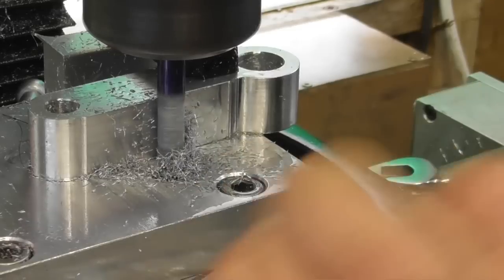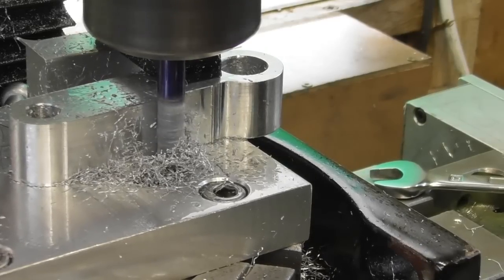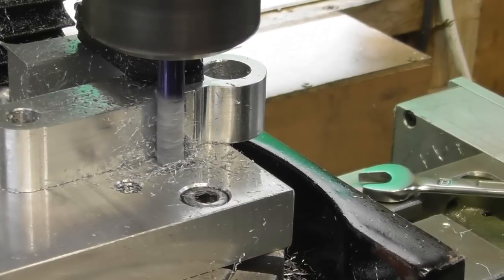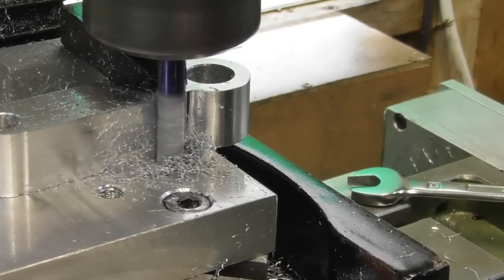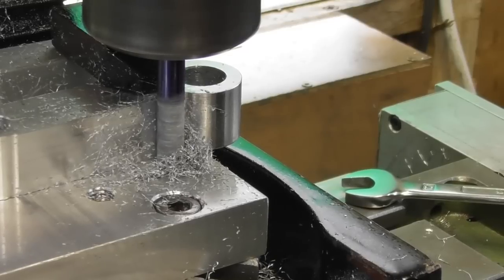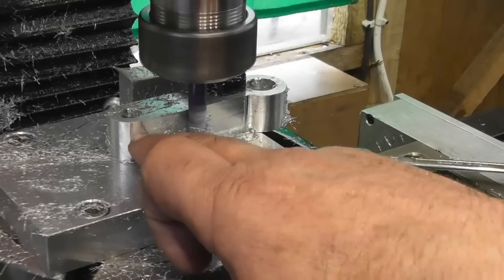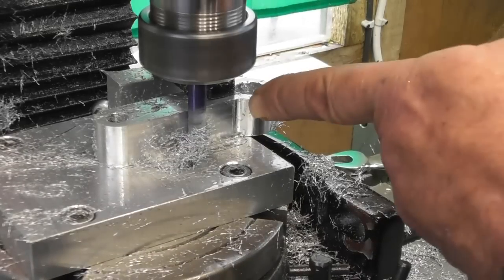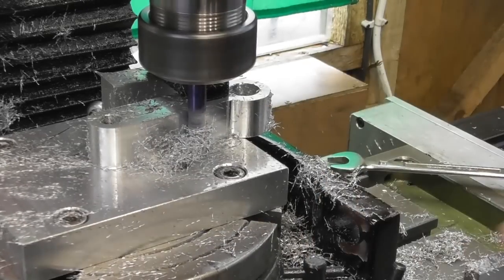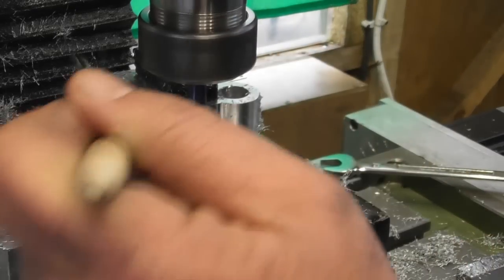I'm just going to drop that down to that intersection point, which is where I was when I cut the rad using the DRO. And that's just tickling across the surface there. Should stop cutting here somewhere. There we are. So I've got two thou left on, and there's just the slightest of witness marks there. So we're on the right track. I'm going to come down into this corner. There's slightly larger witness marks, so I overcooked it a little, but that's not important. It doesn't actually do anything in the finished part, but that'll come to light a bit further on.